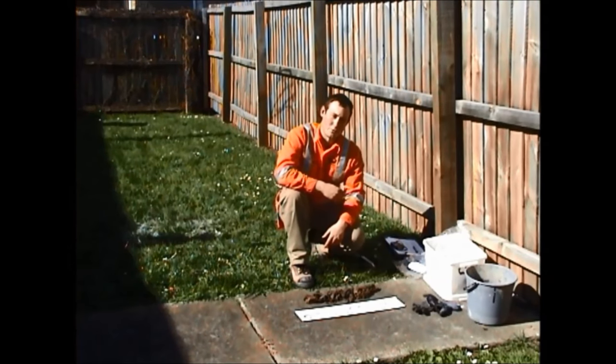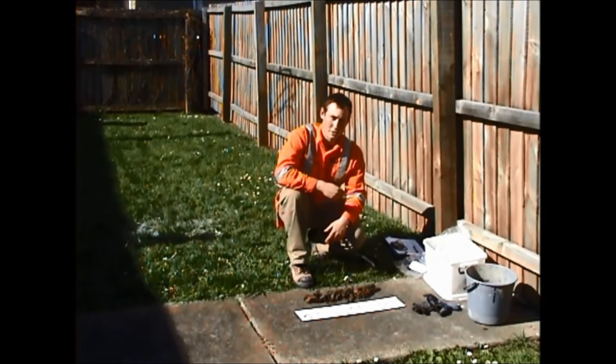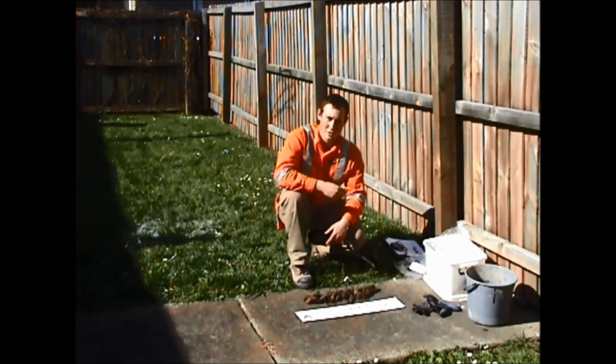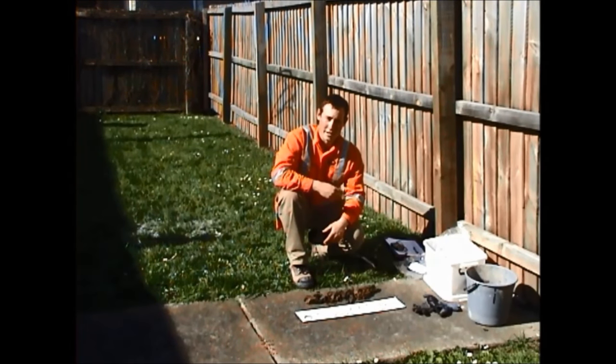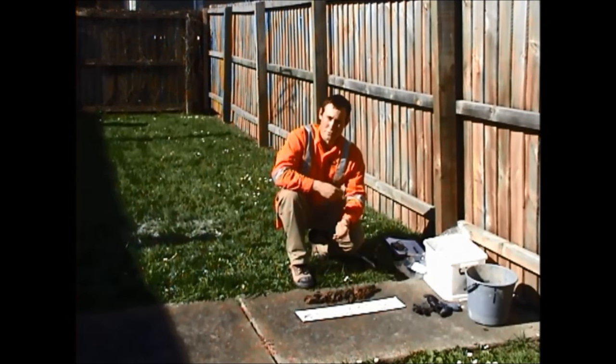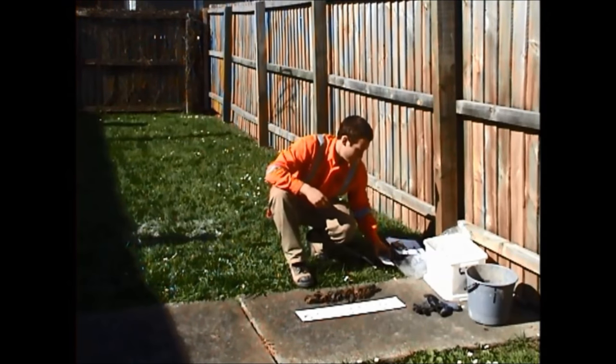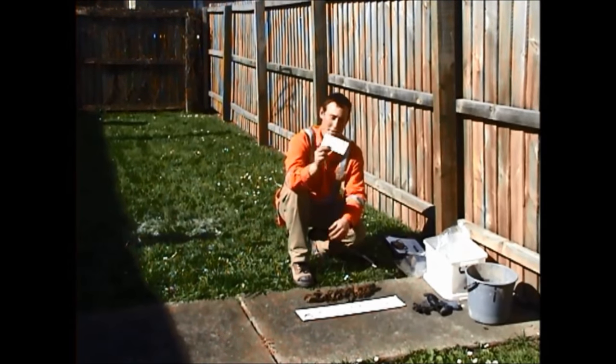Sometimes you have to take samples. When you're taking a sample, you have to know what sort of material you're required to sample — in the case of whether any lab testing is to be done, at what frequencies, or even if samples are needed at all. If you are required to take samples, for example for a water content, fill out a sample card like this.